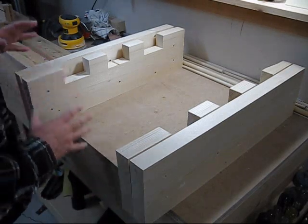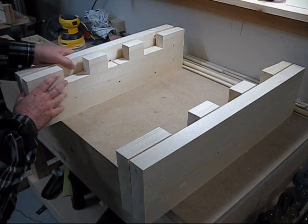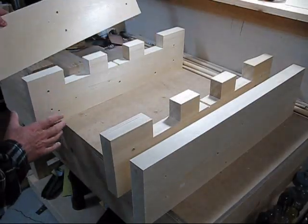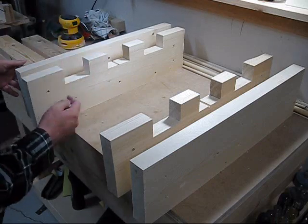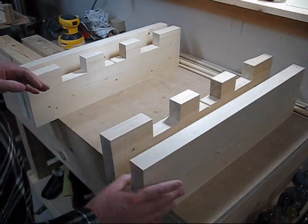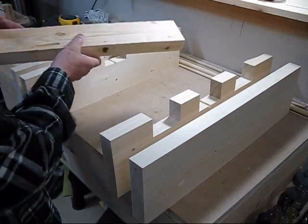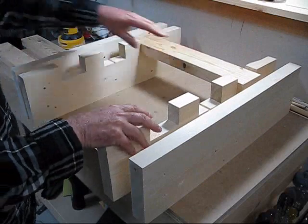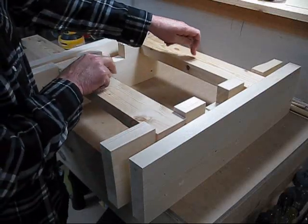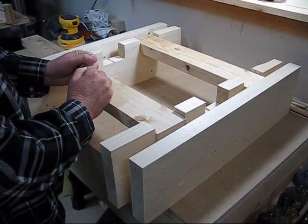So this is what I came up with. I took some 2x8s and cut them down to 6.5 inches each. I'm going to put these two on the insides of the floor joists and this one on the other side, sandwiching the joists. I'm going to put a bunch of carriage bolts through and bolt them all together — that should add a ton of support. Initially I also made some pieces from construction-grade 2x4s that I planed and ripped to look a little nicer. I wanted only two of them, one on each side, at 12-inch centers. But then I realized I made a mistake with my calculations, and I'll show you why.